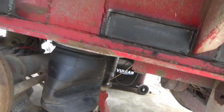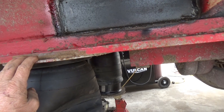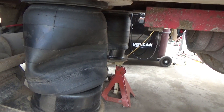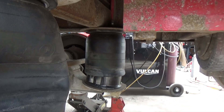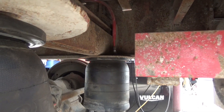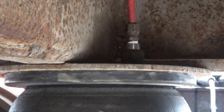What I'm going to do is move this plate. I welded this on when I bought the trailer because it was attached to the old airbag but broken off of the frame and just hanging loose, flopping around. I welded it on where it looked like it was right, but putting the new airbags on, it's not lining up like it's supposed to. If you look at how the bag is pretty well centered in that steel plate on that side, but over here, even though these are homemade plates added on later, it's not centered.